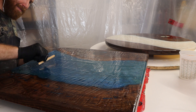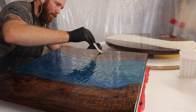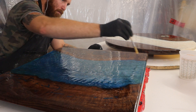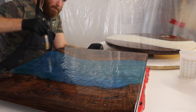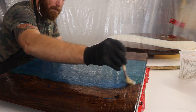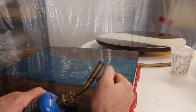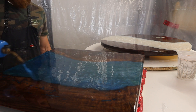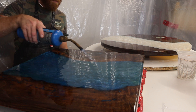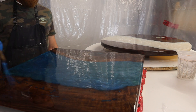In my old shop I always cleaned really well and had dust collection, and I'd do resin top coats thinking everything was good, then come back the next day to find a piece of dust — and it would really piss me off. So now I take the extra time to make a dust-free zone. You saw me kind of chopping it up — that works well to even out the coat — then I hit it with the brush to smooth it all out. I always prep my brushes by putting super glue around the base and crimping it down a little tighter to prevent brush fibers from getting into the resin.